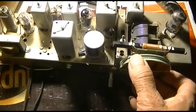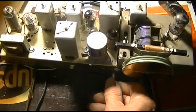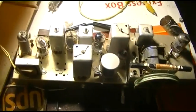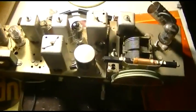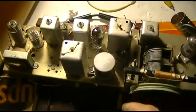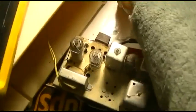Else on the radio, on the TV show, I have to tell the truth. And you know what? If I'm wrong, I gotta man up and say I was wrong. Well, the fact is that the sensitivity is there, so it's not the front end. It's probably something in the IF. I check these tubes. I need to test these tubes.